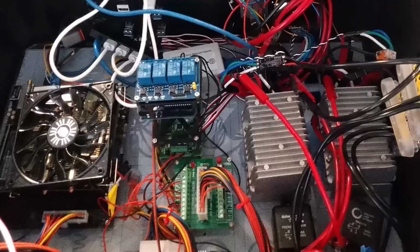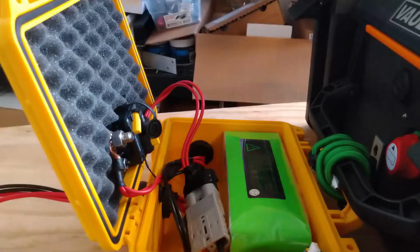So this year, we bought an ATX breakout board. So we plug this ATX cable into that board, and we have all of our voltage supplies coming out of that, so we can save the cable, and we're also making it a lot more neat and organized and easier to track if something goes wrong.